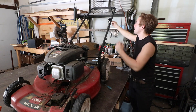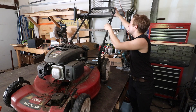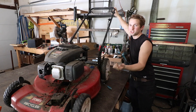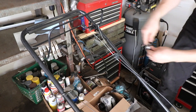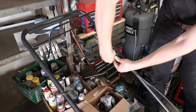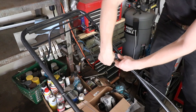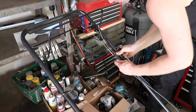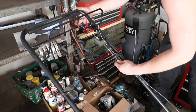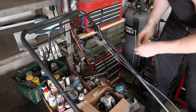In order to adjust the linkage, there are bolts right here. I'm going to loosen that up and pull it forward, and that'll tighten up the linkage a little bit. I want it just so that when I start to lift up the handle, it pulls that pulley taut. This is a seven-sixteenths — I'll just loosen this up a little bit, then tighten it up. I think that'll be pretty close.